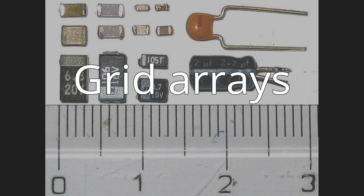Land grid array, LGA, an array of bare lands only. Similar in appearance to QFN, but mating is by spring pins within a socket rather than solder. Column grid array, CGA, a circuit package in which the input and output points are high-temperature solder cylinders or columns arranged in a grid pattern. Ceramic column grid array, CCGA, a circuit package in which the input and output points are high-temperature solder cylinders or columns arranged in a grid pattern. The body of the component is ceramic. Leadless package, LLP, a package with metric pin distribution, 0.5 mm pitch.